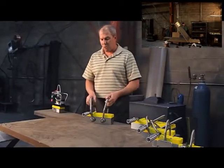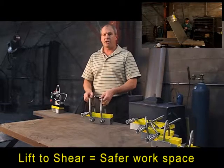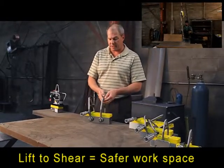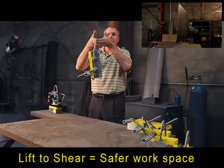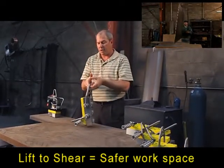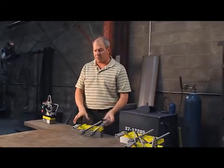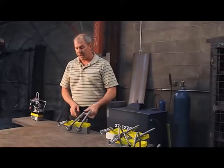What's also great is if you want to destack and pick up a sheet in shear, you can actually bring the crane in and hook it to one of the hooks and it'll work like this — pick up your load and lift it that way. So the very same lifter, without having to change out hooks, can be configured to lift stable, flat, and in shear.